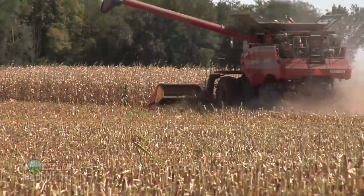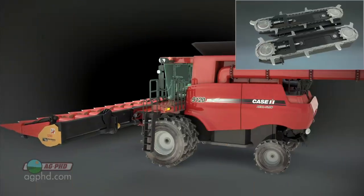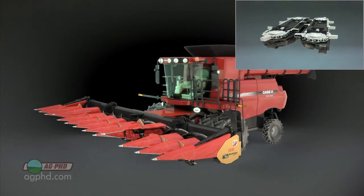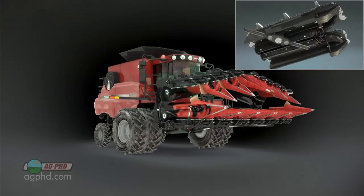Fourth: durability. There's a big difference in many factors on a corn head when you look at the fine details — like how the deck plates are shaped. Ours, for example, have a rolled edge design which should multiply the wear life by as much as five times normal deck plates. It also has an upward beveled shape to pick the ear cleaner and minimize loss to shelling.